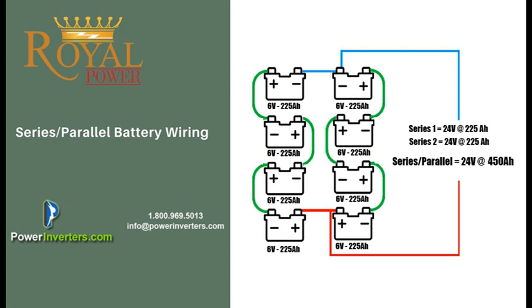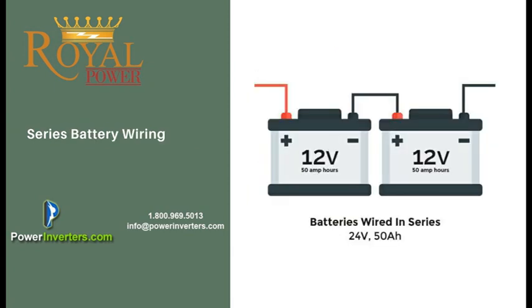If you ran out and got 20 different batteries, you're going to want to set it up properly, because if you damage your equipment on installation, everything's going to be at a loss. We can help you with that. We also have a video showing specific alignments — I'll put it up in this video showing parallel systems and series-and-parallel systems. If you have multiple 6-volt batteries, say 36 of them, you're going to want to run them in alignment of sets of two or sets of four depending on 12 or 24 volt, and then run the batteries in parallel from that system, creating your battery bank with proper alignment.